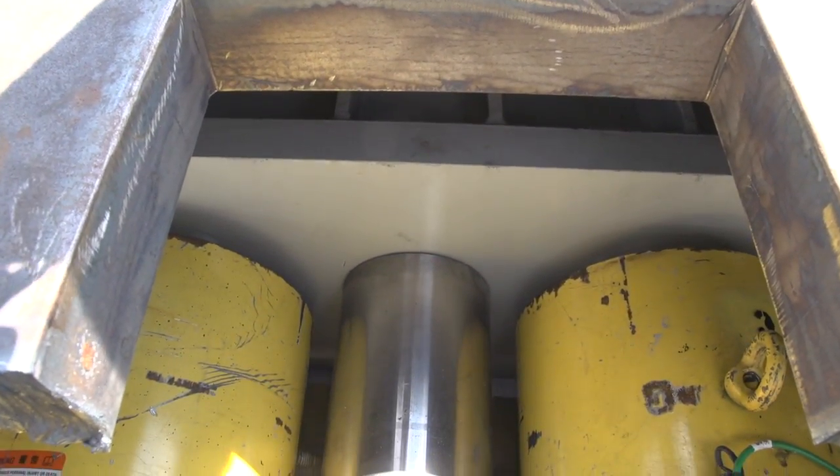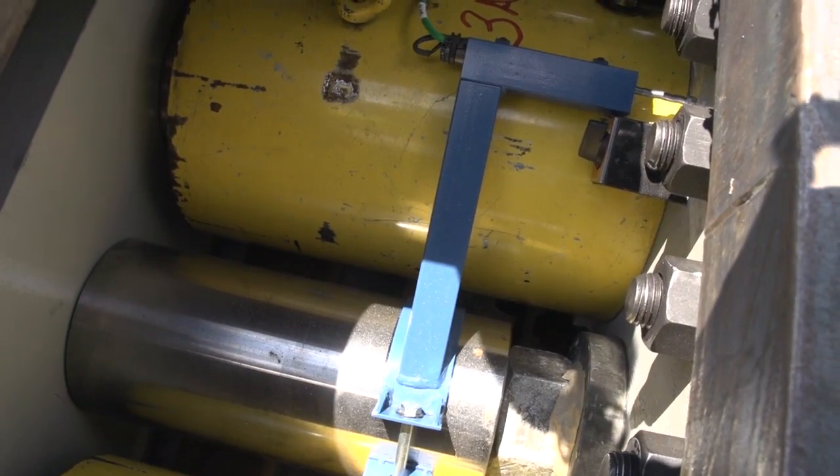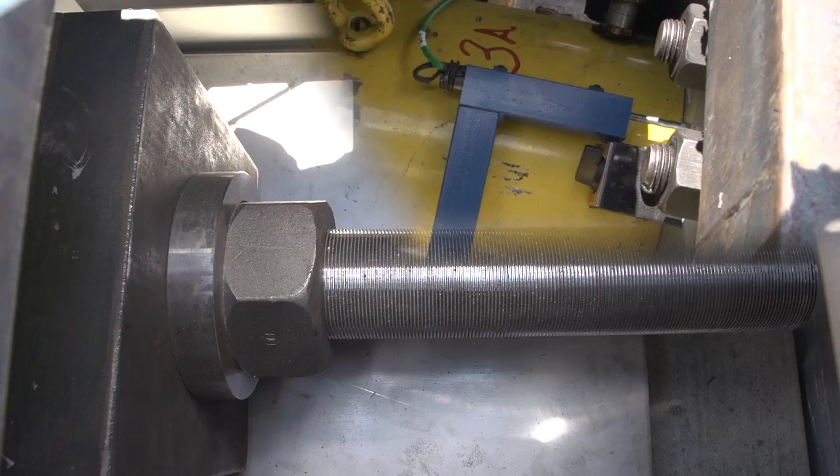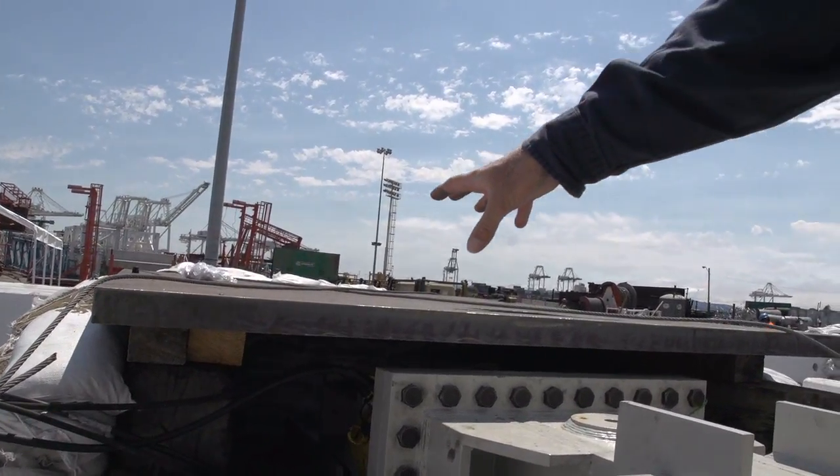Over a 23-day period, the pressure will begin at 30% load for 48 hours, then 40% for 48 hours, then incrementally increased step by step past its bridge load of 70%. But if it still hasn't broken by 0.85, we are then going to pull it until it breaks.